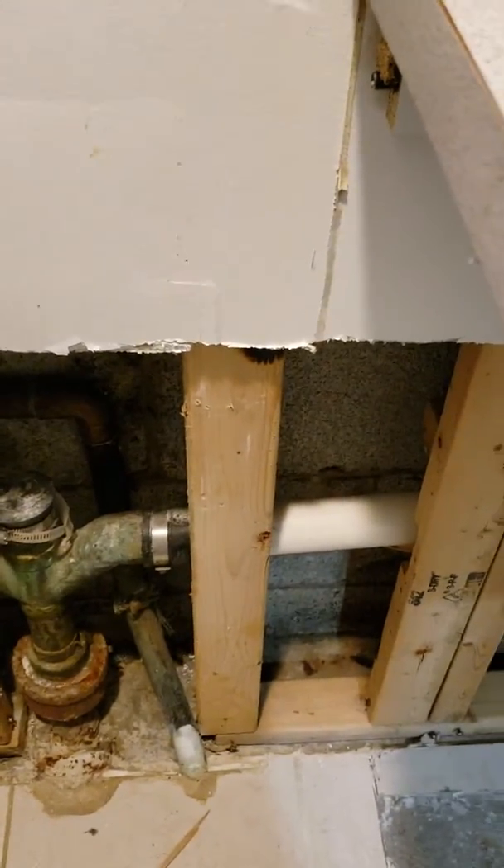There's no vent. There might be a vent back up there, but we might need to add another Studor vent from here — from back there past where the second laundry machine ties in — on around three inch, and come in. So then three inch down, inch and a half Y for this lavvy sink vent coming up, and all the way this way, almost 10 feet to right there.